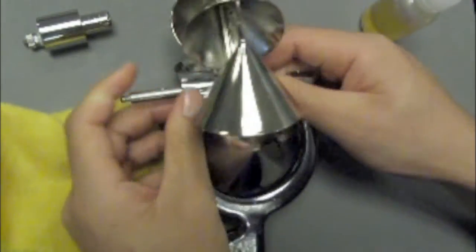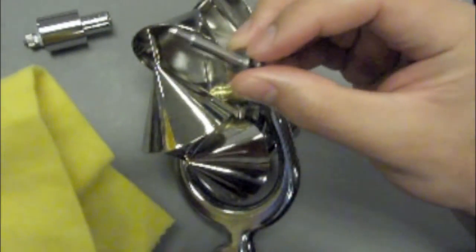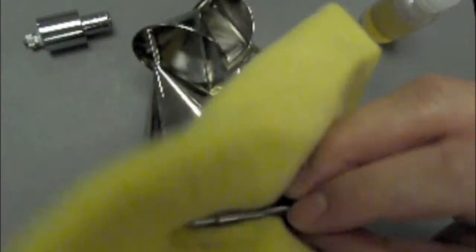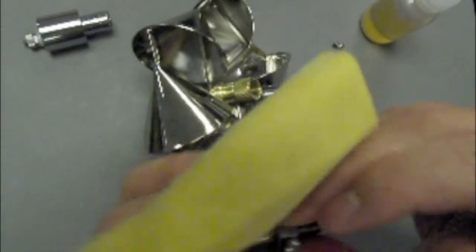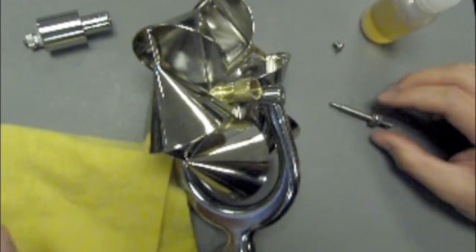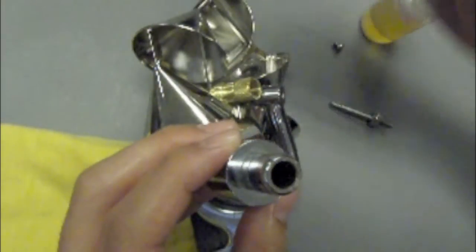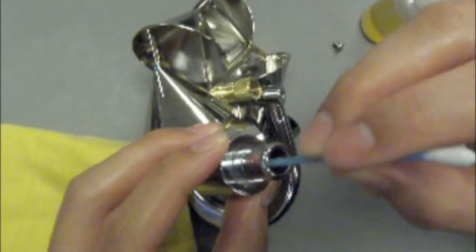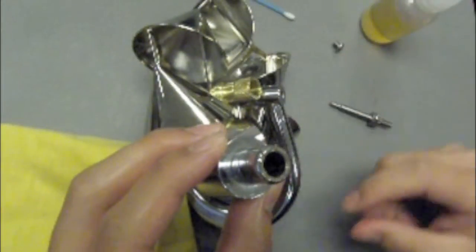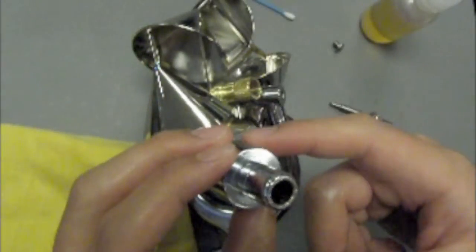Next, we will clean the pivot. Clean the pivot also with a large soft cloth and wipe it until it is thoroughly dry. Finally, we will clean the contact chamber with a cotton tip swab by swabbing it from the bottom. Occasionally, you might want to clean the contact chamber by allowing a forceful stream of hot water.